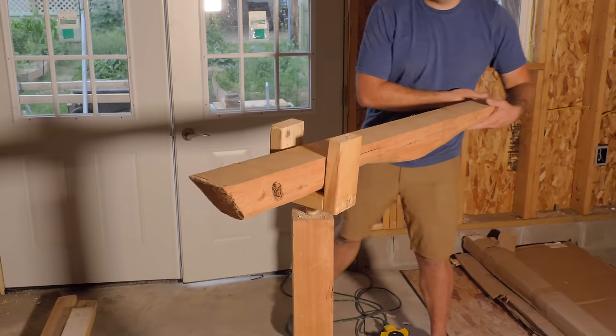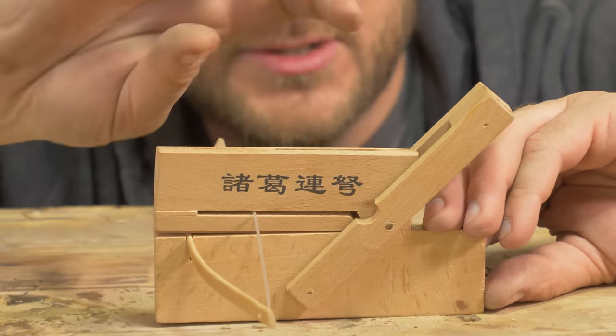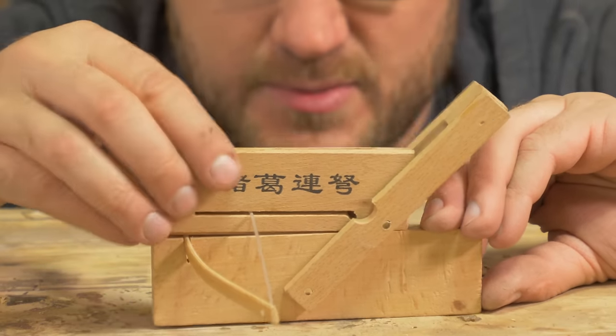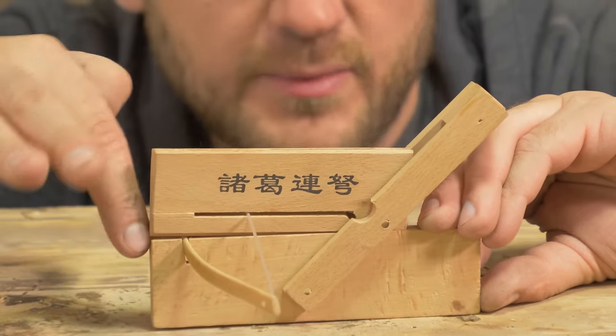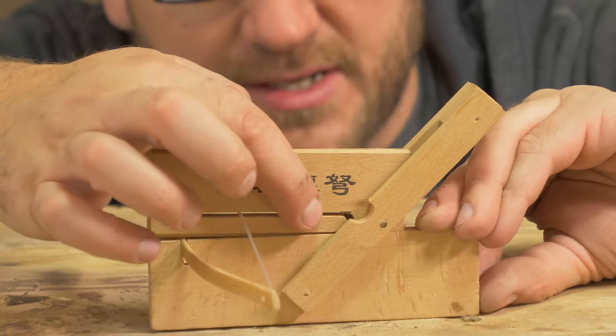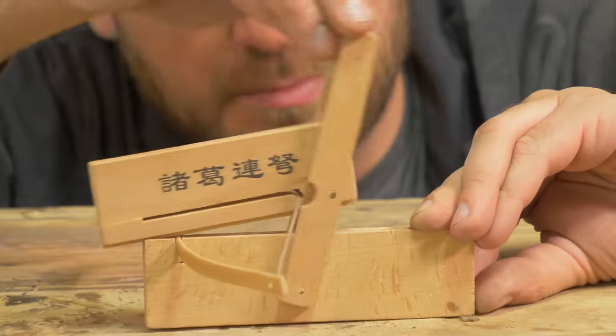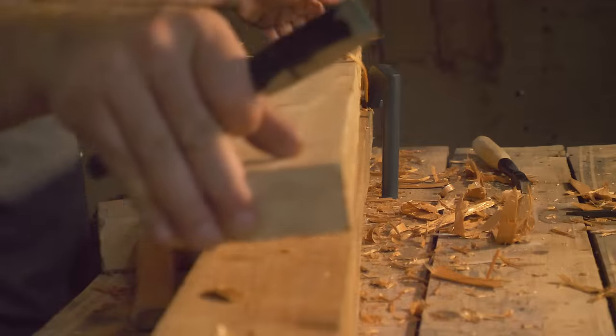The next step is going to be this upper portion, or kind of an arrow holster. This is going to be the device that holds the actual arrows and allows them to drop down. So it will be able to slide back and forth on the rail that we carved into the stock. There's a slot here for the bowstring to go into, including a notch that it gets stuck to. So then when the whole device is pulled back, it fires.